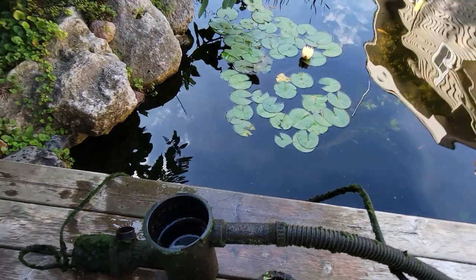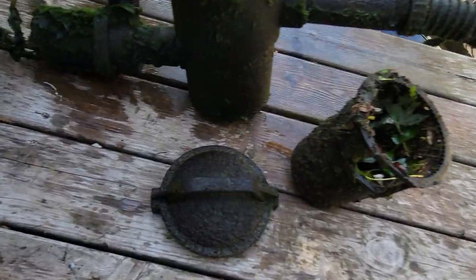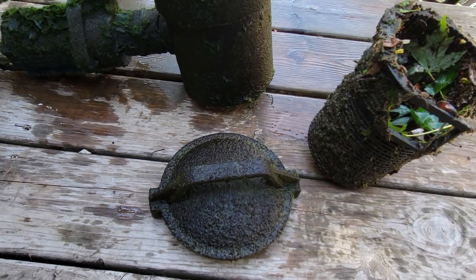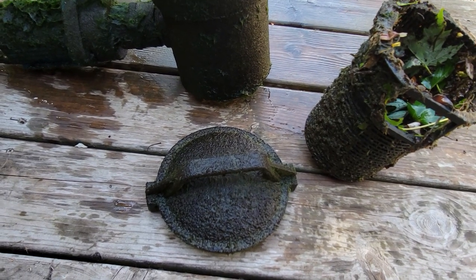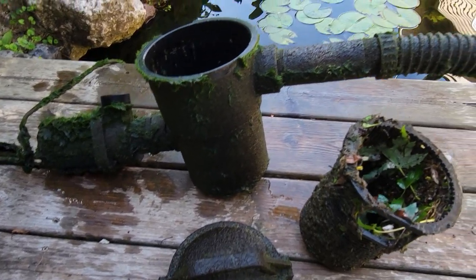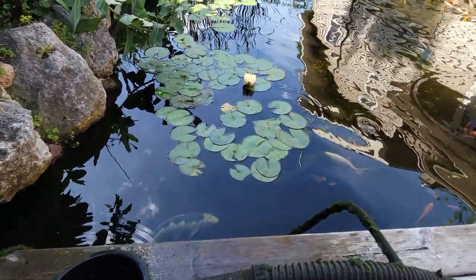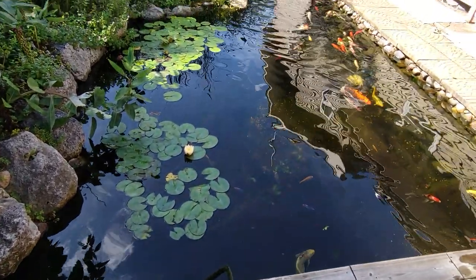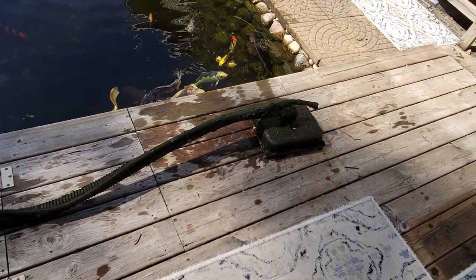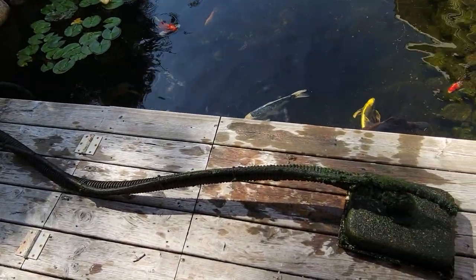Also on this lid I've got a tiny hole drilled in the top. Should I ever have a leak or problem with my barrel system, since this is before the pump, if the water level ever gets down and hits that tiny hole it'll suck air in and cavitate the pump — it'll still be running but won't move any water. So I'll lose some water, but I'll still have 18 to 28 inches in there. It's kind of a fail-safe.